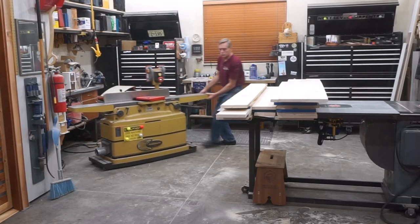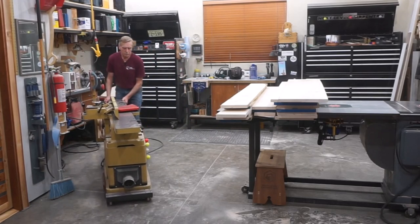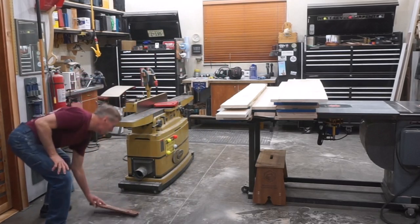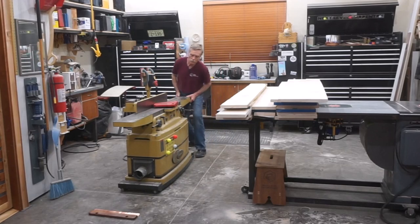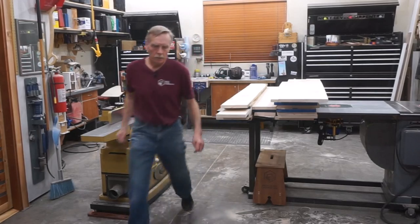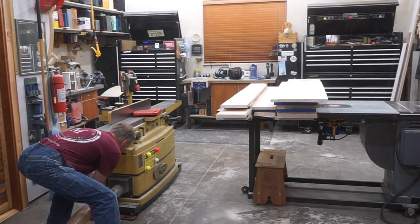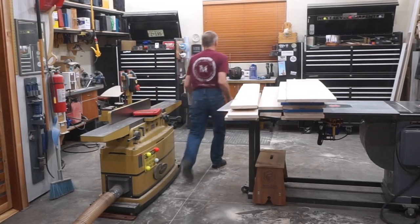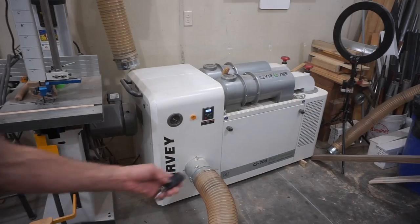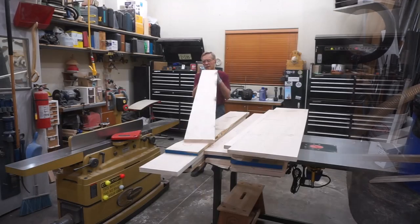In the modestly sized Next Level Carpentry shop, I've got to do a little bit of reconfiguring to get set up for the next step, which is to use the jointer to quickly straighten the best edge on each of these rough sized planks. Because I need the shop to be versatile, all the equipment is on wheels, and my dust collection consists of flex hose that I can adapt to any equipment configuration. The configuration I use for this step places the jointer near the end of my rolling work table where I've stacked all the rough planks within easy reach. Once the configuration is complete, I fire up my GyroAir G700 dust processor and set about straightening those edges.